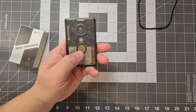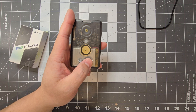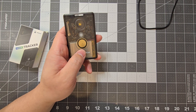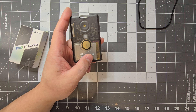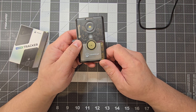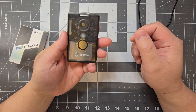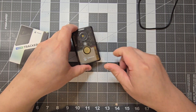It's got that little speaker there. You can connect to your phone if you want to turn off the buzzer. You have to go into the device configuration and change the pin buzzer — I think the default is 25 — and just change it to something else. I tried zero but it didn't work, so just try a different pin number like five if you want to turn off the buzzer. This is a really good device if you want something light, easy to carry, and quite rugged — I highly recommend this one.